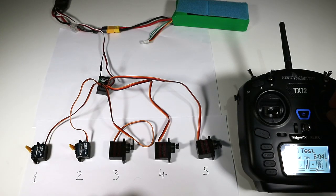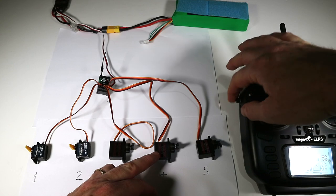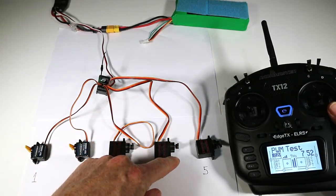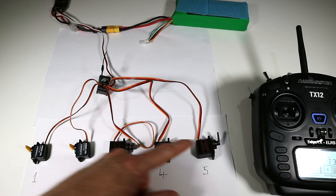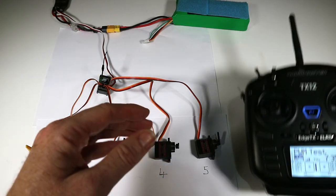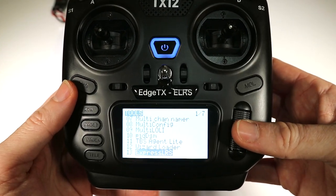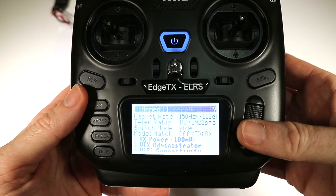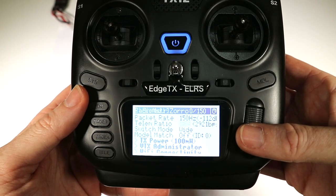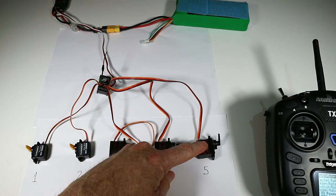We're back, we've updated the settings. Channel one, two, three, four still the same. Channel five is no longer connected — if I move this slider, nothing happens. Channel six, on the other side, gives us movement — you can see it moves. It's a bit jerky, but if I move it really slowly you'll see it actually has some resolution. What it's got here is 64 positions. Now if I pop into ExpressLRS, we're on 150 Hz with a telemetry ratio of 1:2. If I move beyond 1:4 — say I want 1:64 — that should give us 128 positions, but it still looks really jerky.